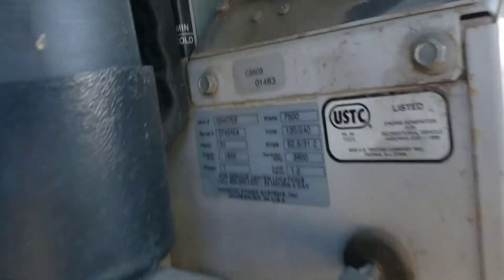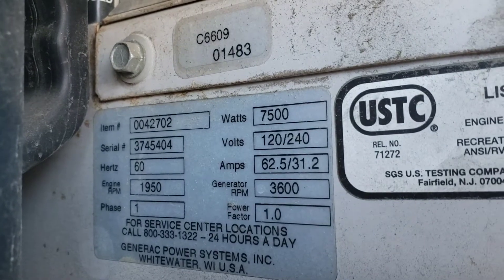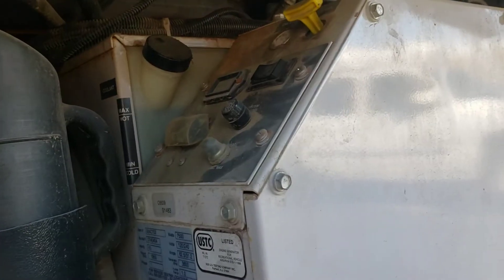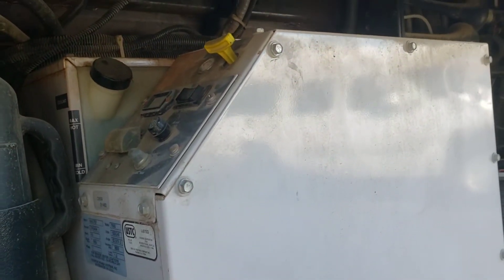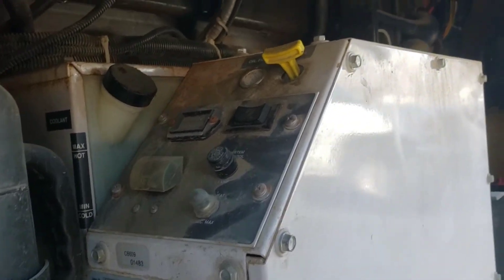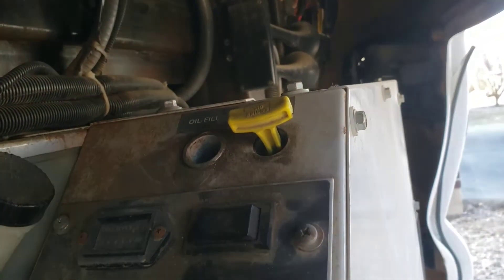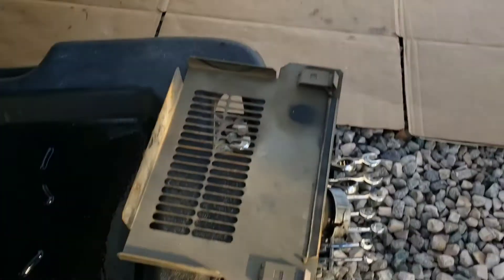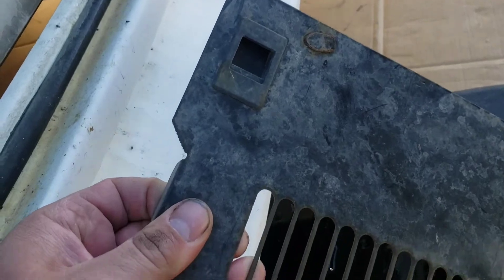Let's move in a little bit here. There are the specifics. I'm honestly not sure what model of Generac this is, just that I've done this before and I've got a list of part numbers that happen to work. You've got your hours, your outboard start panel, all that stuff. You've got your oil fill, which is in a disastrous location, and the oil dipstick there. I'm going to go underneath. There's a little panel here that just removes with a couple of push-button style retainers. That comes off and we can get access to everything we need to, including the drain plug, the oil filter, and the air filter.